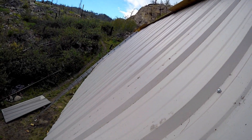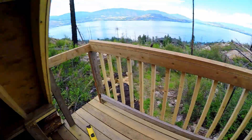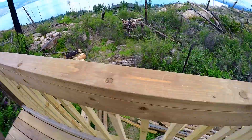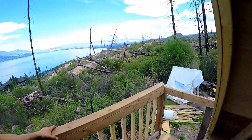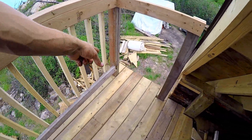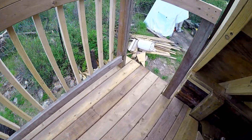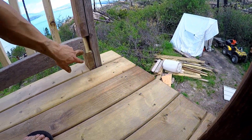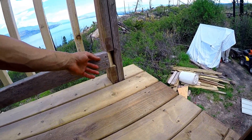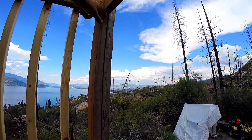But yeah, that tin roofing was a pain in the butt by myself. And then I also did all of this — woo! So obviously not finished yet, these little sides I've got to do, but this thing is pretty sturdy, pretty beefy, pretty nice little porch out here. I screwed these posts into my joists underneath, did my decking, and as you can see in my corners I 45'd them. Nothing super fancy, but I just notched this post out so this 45's — like you can see up top here, both of them 45'd, so both of these guys have support on here.